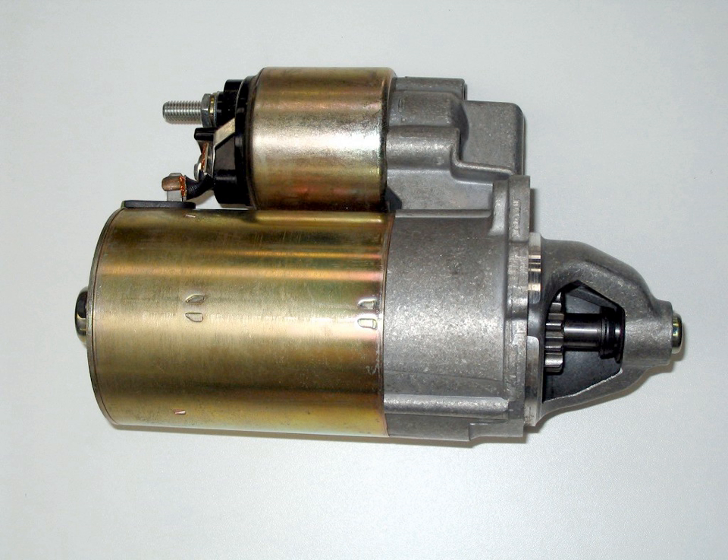The cylinder head needs to have enough space to support an extra valve for the air start system. The air start system is conceptually very similar to a distributor in a car. There is an air distributor geared to the camshaft of the diesel engine; on the top of the air distributor is a single lobe similar to what is found on a camshaft, with roller tip followers for every cylinder arranged radially around it. When the lobe hits one of the followers, it sends an air signal that acts on the back of the air start valve in the cylinder head, causing it to open. Compressed air from a large reservoir feeds into a header along the engine, and as soon as the air start valve opens, the engine begins turning. It can be used on two-cycle and four-cycle engines and on reversing engines; on large two-stroke engines, less than one revolution of the crankshaft is needed for starting.